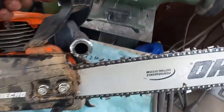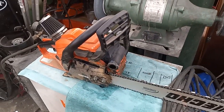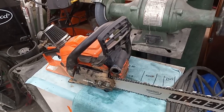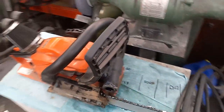I did end up restricting this down just a little bit. I'm going to see how that does tomorrow — I think I was letting a little bit too much out. I did some test cutting with it, and I'm just trying things right now, so if it doesn't work out, I can just grind the welds and pop my restrictor back out of there.